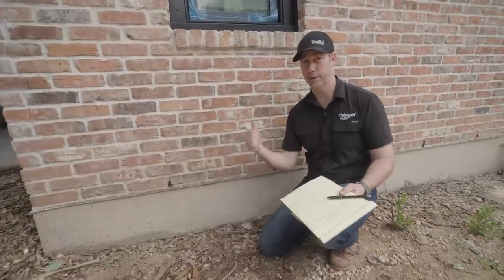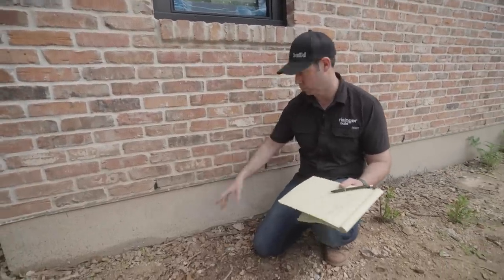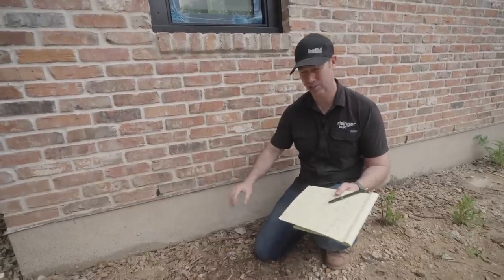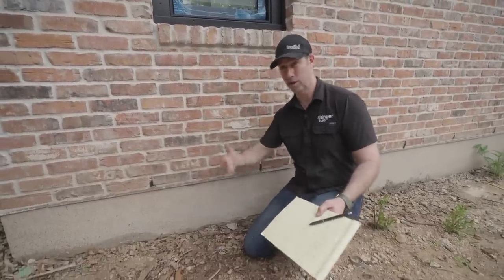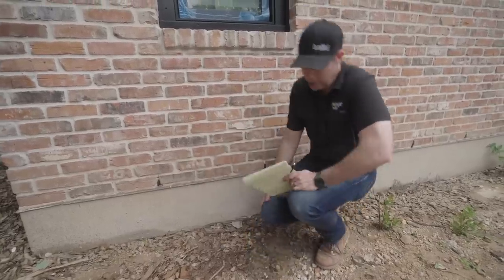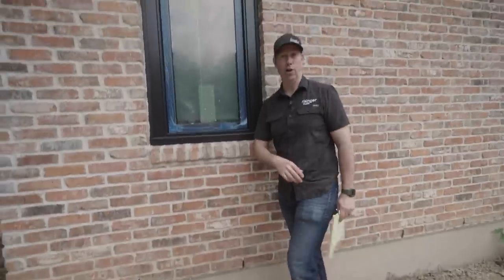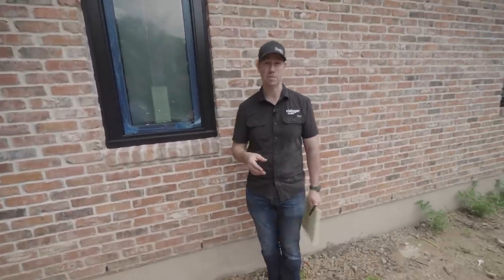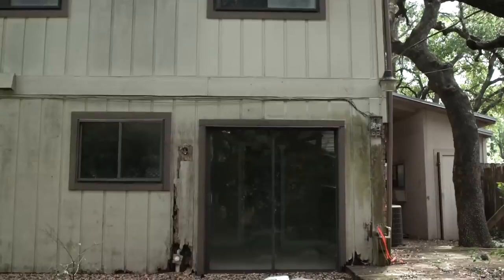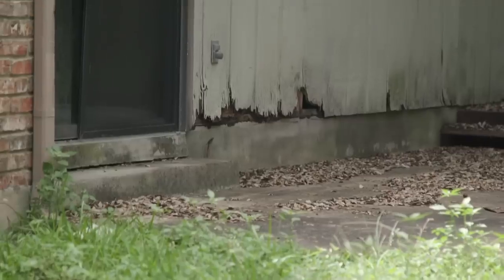Now I spent a lot of time and effort to waterproof behind everything. You can see I've got this copper flashing right here that's a through wall flashing. But even if I've got everything waterproof, I'm still gonna, number one, get my house really dirty. And if I didn't have a house that had all those details perfectly behind it, that's where a lot of rot happens. And in fact, the house that was here previous had some serious damage from lack of gutters.